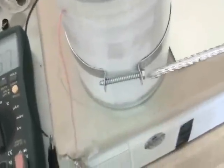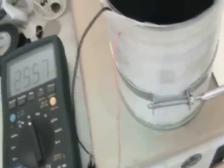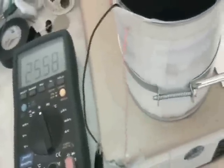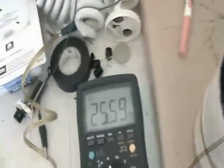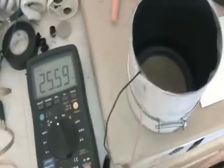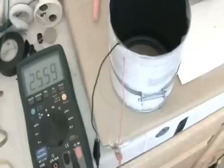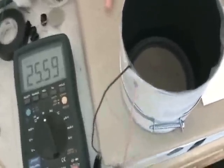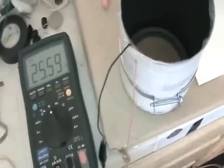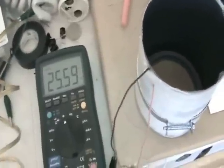So I imagine you would just dial in the capacitance that you want, or basically use this as a variable capacitor. Now, it's hard to buy variable capacitors in the nanofarad range — the stuff that is sold is in the picofarad range. So I think that's why Hendershot built his own, and even today, 80 years later, you still have to build your own because you cannot buy these components easily.